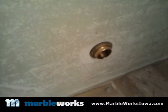We put our drain assembly into the floor. Any time you put a drain assembly into a composite material — whether it's fiberglass, a solid surface, or a culture marble like the Marble Works floor — you want to make sure you use silicone and not plumber's putty. There's silicone underneath this ring all the way around there, so don't use plumber's putty on that joint.